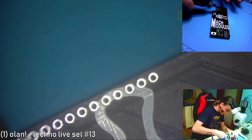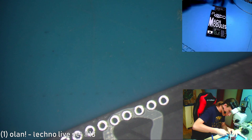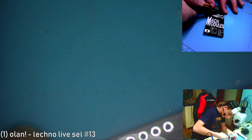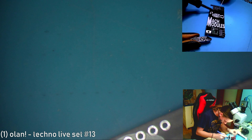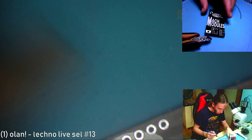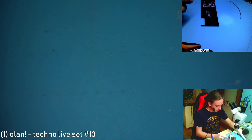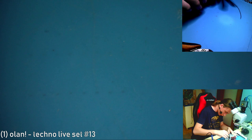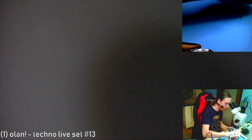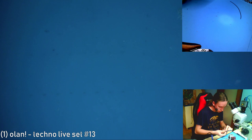Okay, snip those legs. Okay, this one isn't soldered in properly. I'll fix that. Snipping those legs. Okay. Now the 470 ohm resistors going. I don't know why I prepared three resistors when I only need two of them. Okay, solder them on.